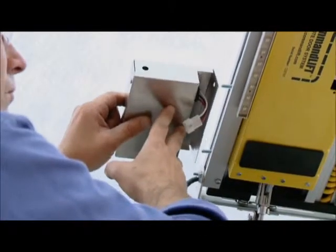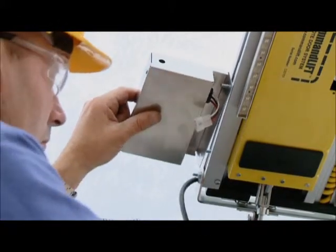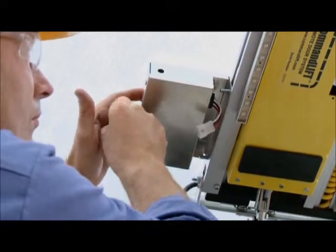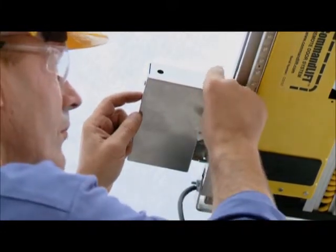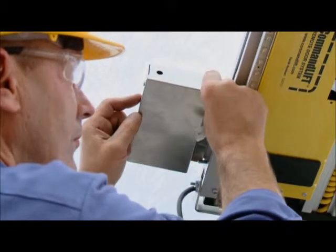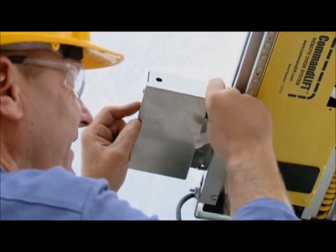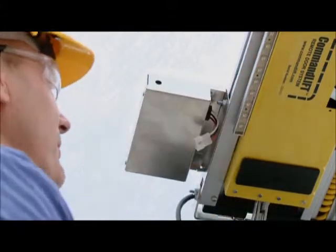The receiver box fastens to the curb side of the CommandLIFT aluminum track at the header of the truck body or trailer. Fasten the receiver box to the 2 machine screws on the track and tighten the box in place as close as possible to the door opening.